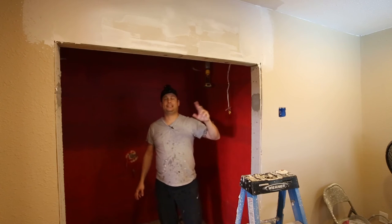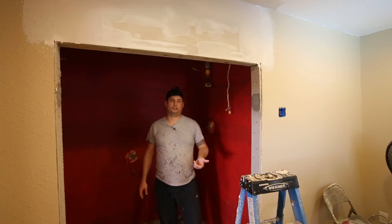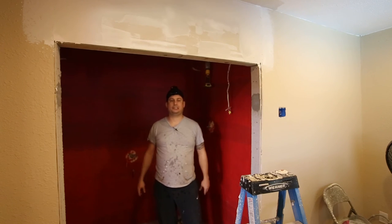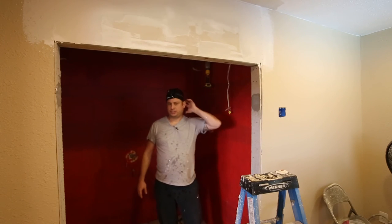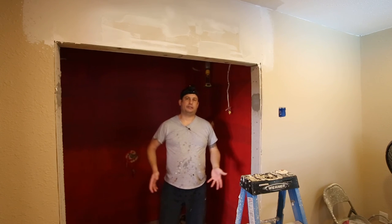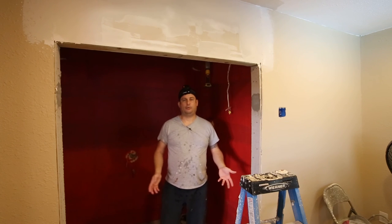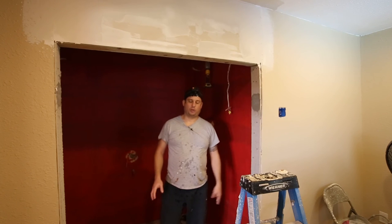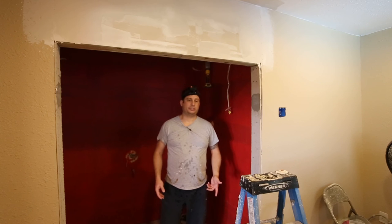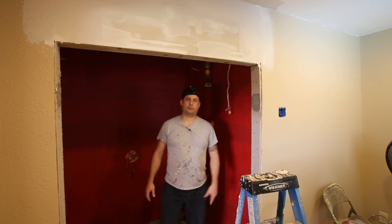I will sand this down, maybe put a third coat on it, and then the next step is to texture it - I'll texture both pieces at once. There's actually a little bit more sheetrock that I may try to taper in, because I'm going to use up five gallons of texture material. When I mix it up I want to get some good use out of it, so there is one more closet I want to include. Thanks for watching, hope you found this interesting and amusing. Stay tuned for more of my videos - make sure that you like and subscribe to my channel.